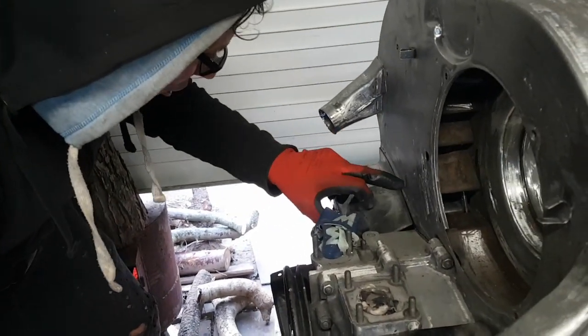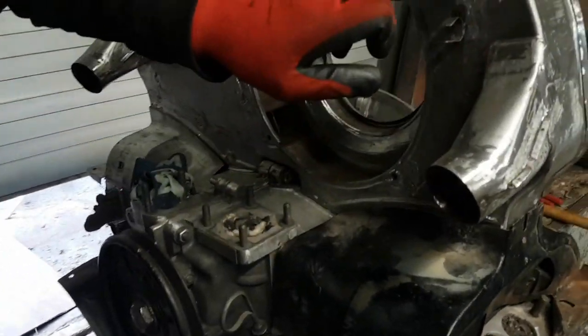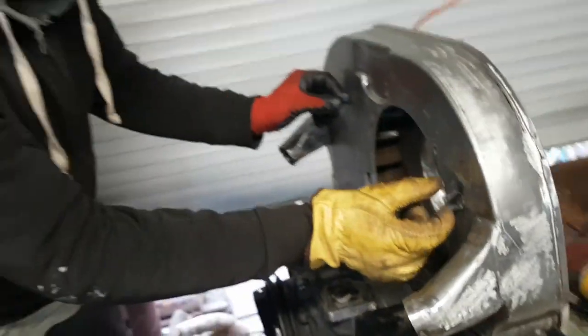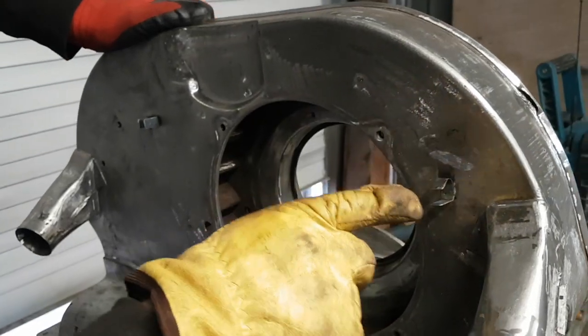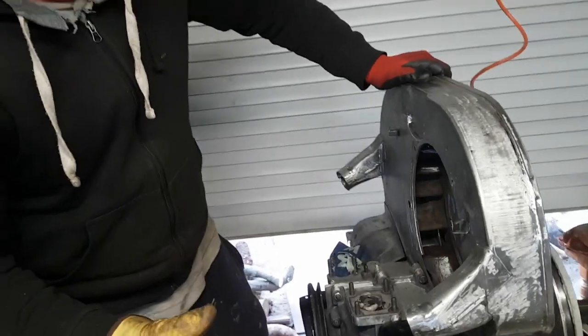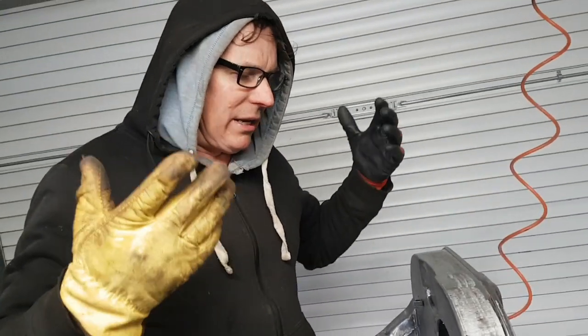One, two, three, four, five, six, seven, eight holes on the front. And put in two brand new tabs here — 50mm long, 1mm plate, 10mm wide. New tabs, never break off. After 50 years of backwards and forwards they get a bit thin and they snap off.